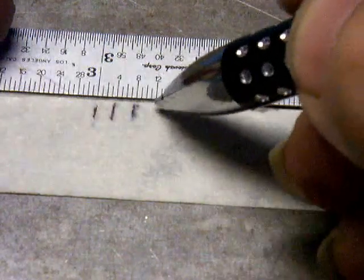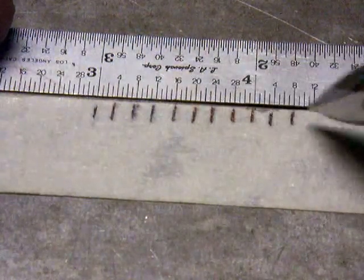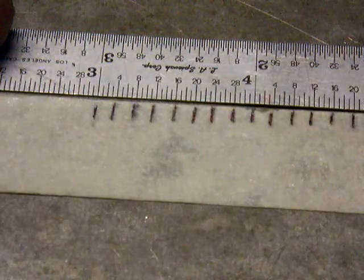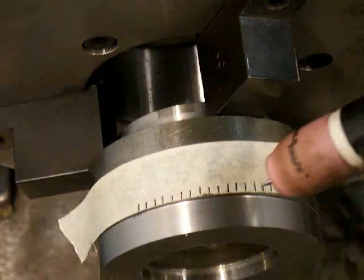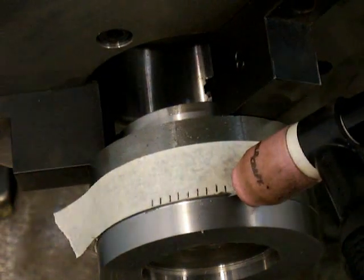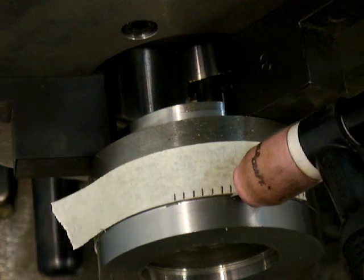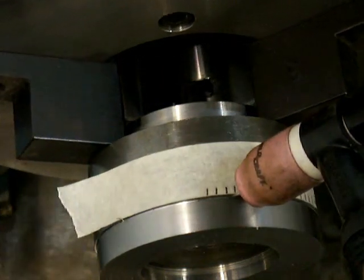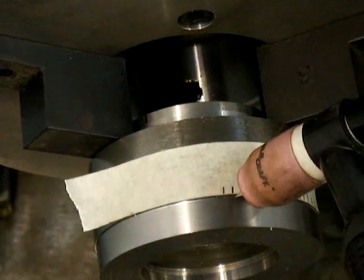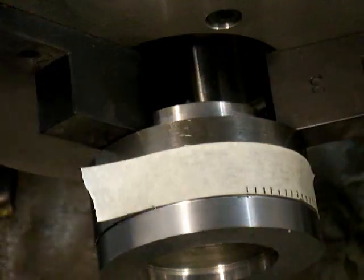Get the increments as close as you can — they don't have to be exact because we're going to be counting in our head anyway, so there's a little fudge factor involved. Place the tape on the round part you're going to weld. Then adjust the table speed to where you've got roughly one-eighth inch per second passing the torch — counting off 'thousand one, thousand two' — basically covering an eighth of an inch every second. When you find the right setting on the knob, write it down in a notebook.